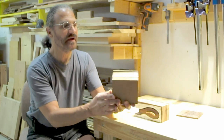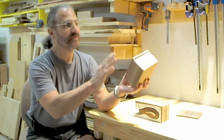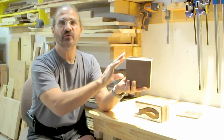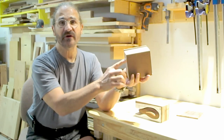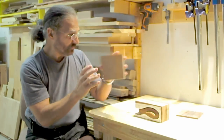Typically, you start with some kind of glue up and you cut the back after you glue on your template, if you're using a template — you cut your back off and then you work with what's left. Then you glue that back on later. It takes a lot of sanding to get out the bandsaw marks from cutting off that little bit on the back.